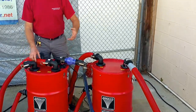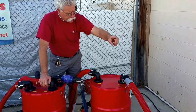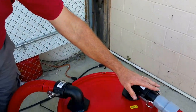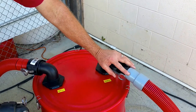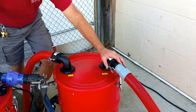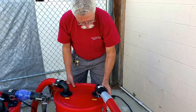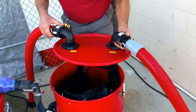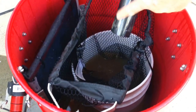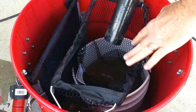When you have a lot of debris being sucked in from something like a vacuuming surface cleaner — when you get off a sidewalk like in a parking lot or parking garage — there's going to be a lot of debris, so we want to be able to suck the water into this big pre-filter, which we call a sand trap. This one has a mud bucket and leaf bag, so the inlet drops debris into the mud bucket and leaf bag.